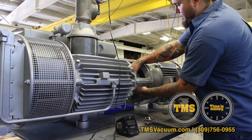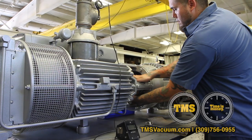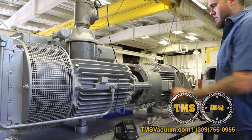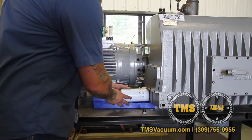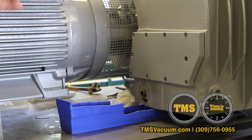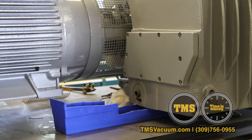Go to the other side of the pump and rotate the pump manually to push excess oil from the rotating module into the exhaust box. After all the oil is drained out, get another pan suitable to hold at least a gallon or more of oil. Place it underneath the oil filter. Remove the oil filter and let drain completely.